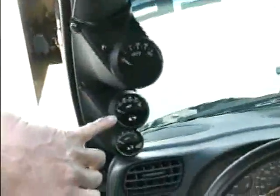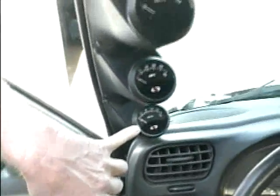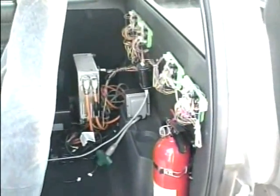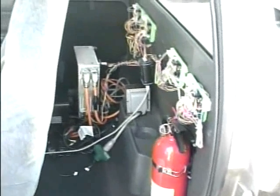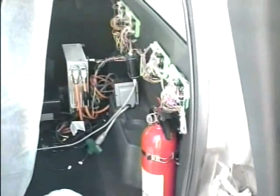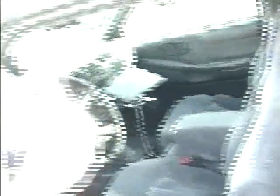This is motor amperage, and this is motor voltage — that's what we're supplying to the motor. The charger and the BMS are on a CAN system. CAN is a communication system — Controller Area Network. If the BMS notices a problem, it can communicate with the charger. The BMS does not make the battery charger go up in voltage or change parameters — all it can do is bring it down in voltage to finalize the charge.